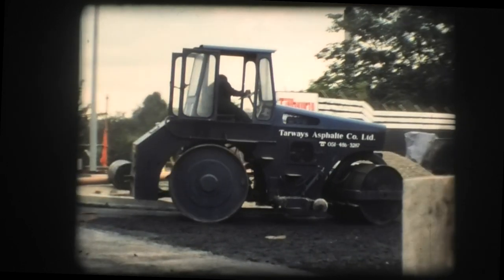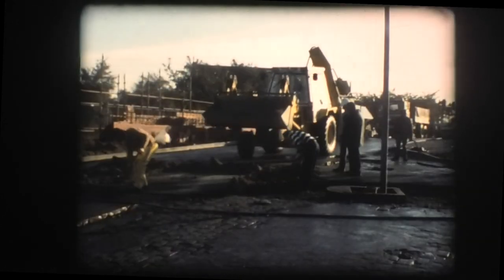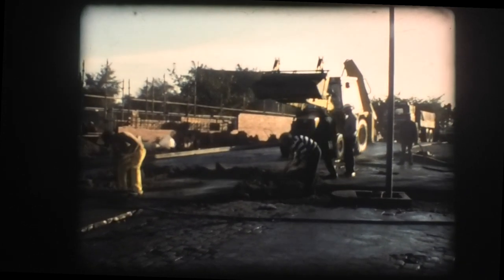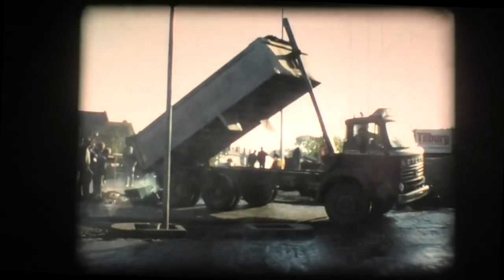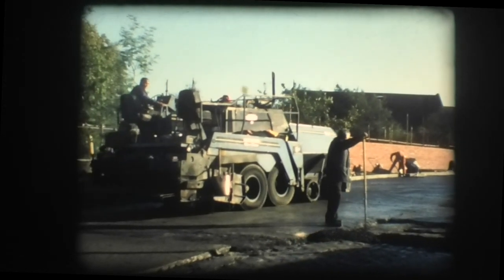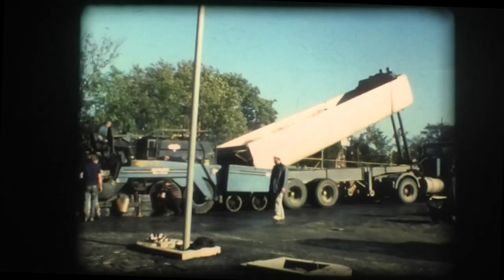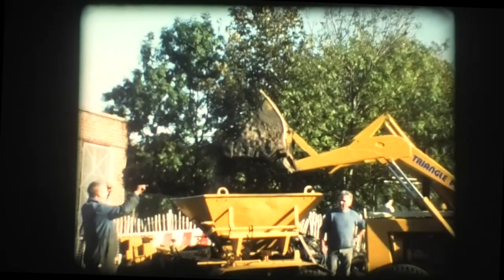There were road rollers, asphalt layers, mechanical diggers, granite hoppers and lorries delivering hot asphalt, causing parking problems in the immediate locality. A quiet word in the right ear by the site engineering staff can sometimes appease the most warring factions. The paver moves back to receive hot asphalt ready for another spread, whilst granite chippings are loaded into hoppers which the paver will pull behind it as it spreads the 40mm thick layer of hot rolled asphalt in a very precise operation.